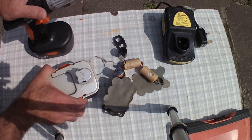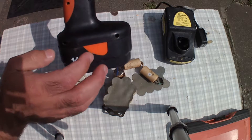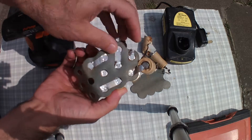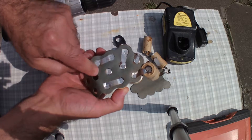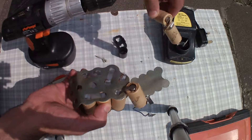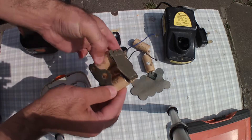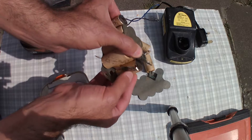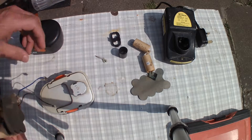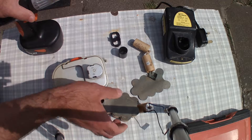This was originally in this casing. When I took it out it was like this. You have these plates that are spot-welded to each battery. Some of them are rusty and they've come off — as soon as you move them they just tear off and snap. That might have been the original problem to begin with. That's what caused the battery not to work, or one or two batteries have gone bad, or all of them.